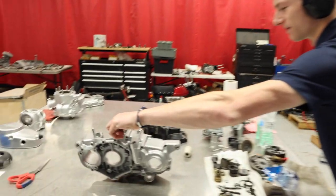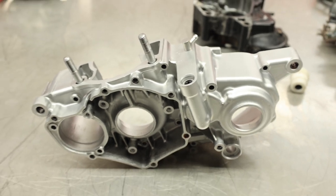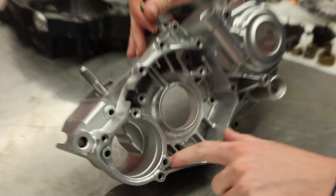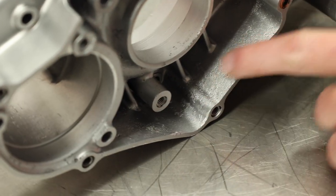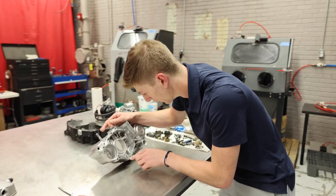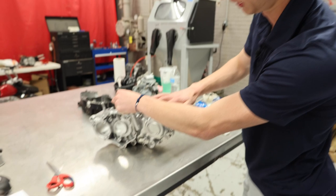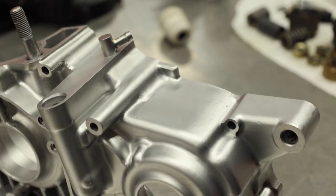I hope this shows up as well on camera as it does in person — that looks phenomenal. The pitting is actually still present and you can see it in a few places, but just through vapor honing it looks a lot better, because it was able to remove a lot of that gunk and grime that was actually in those pits. It should help preserve this part and it really does look a lot cleaner. The pitting doesn't look near as bad, but this outer part turned out awesome. It is so smooth to the touch just from where that aluminum has been rolled — that's a true vapor finish right there.